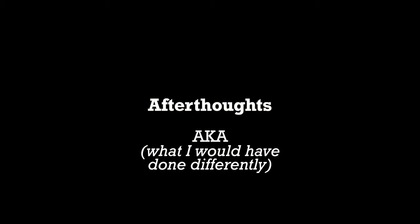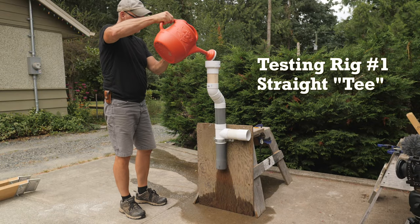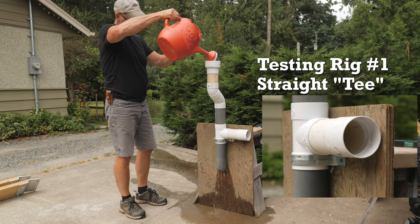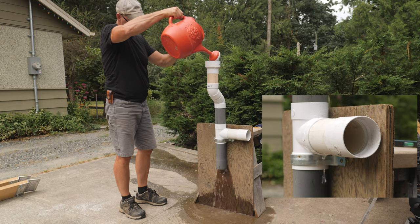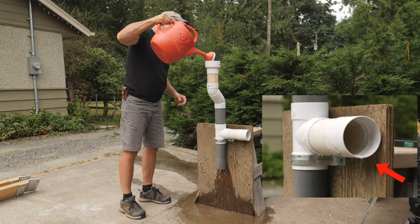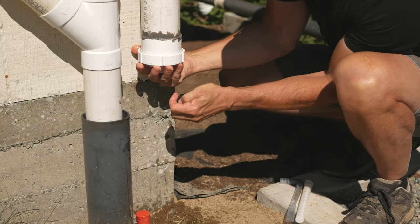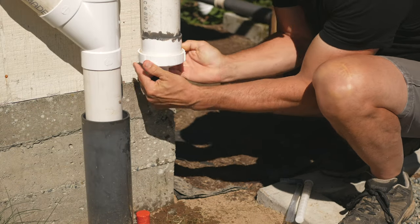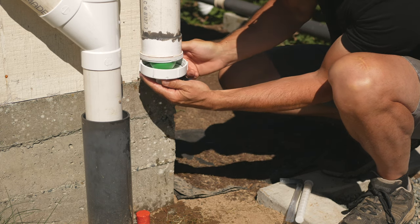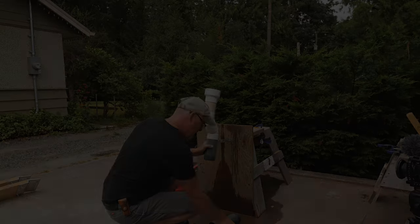With the two T's and the gate valve set up there might be a bit of water that splashes over when the valve is open in the winter and ends up collecting in the first flush chamber. This occurred to me after I put my system together and I realized this is something I should have tested first. So I put together a rig to see how much water might end up running over into the first flush chamber when the gate valve is open. There wasn't a lot so I'm not too worried. In the winter when we get a lot of rain I'll remove the float ball and slow release pinhole washer so water can drain quickly through the small clear hose into the 4 inch drain pipe.